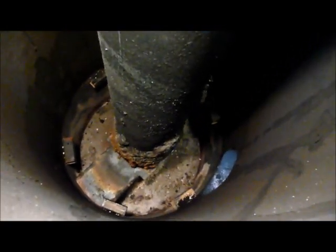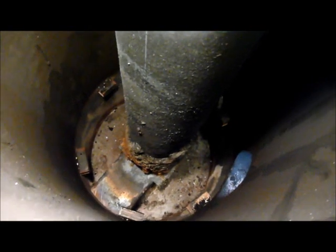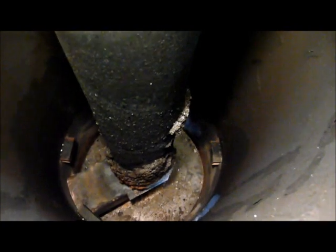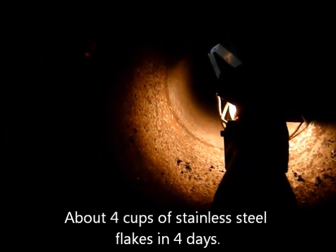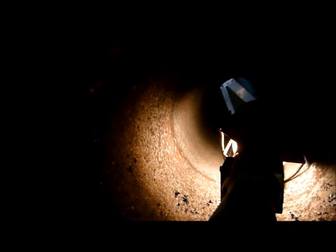The insulation on the side of the heat riser is fused — I've tried knocking it off and it will not come off. But if you look down there at the combustion chamber, you can see the result of extreme heating. You can see the flaking right near that bulb, just below it. That shiny material is what I was finding in the ash pan, and you can see that flaking all the way around.